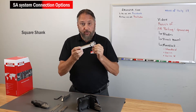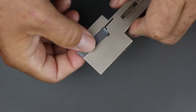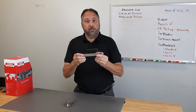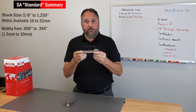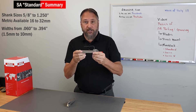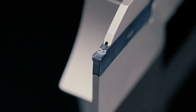I'm going to talk a little bit more about the three different styles of monoblock holders that we offer. This is our standard monoblock holder. It is designed for the larger kind of work that you would see in a traditional chuck-and-turret machine. It is offered with a shank size from five-eighths square to inch and a quarter square, which would be 16 millimeter to 32 millimeter. The grooving widths are available up to 394 thousandths, which would be 10 millimeter. The maximum depth of cut on this series is 1 inch 476, and the maximum diameter this series will cut is 2 inch 953. It is available in no coolant or ACS-1 through coolant.